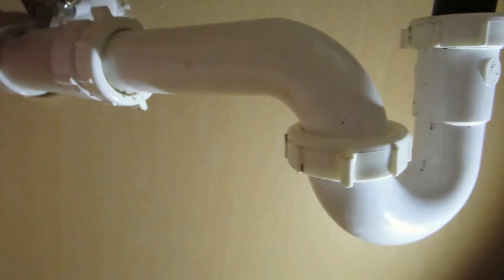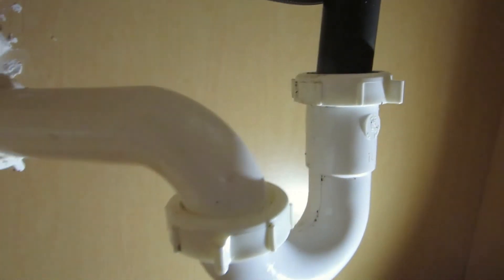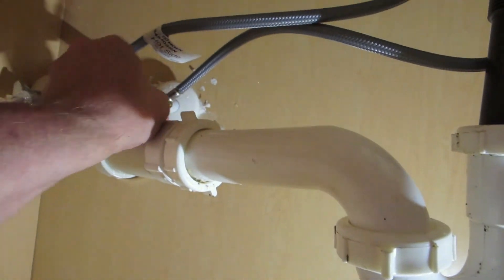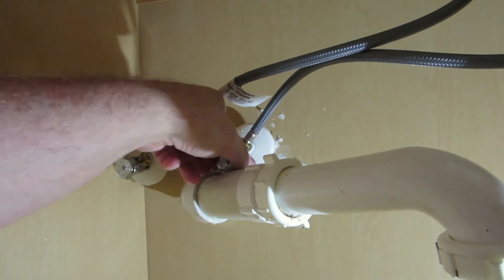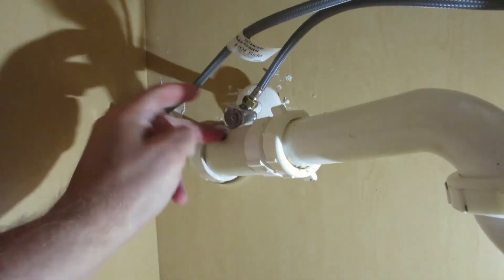One thing — you've got to keep your old parts from your old drain. This little gasket piece has to be angled down with the little plastic thing on top so you can put your P-trap back in. Now I'm going to turn the water on and see if this thing actually works. It's a lot easier to turn the water on and off. This thing is getting wet.